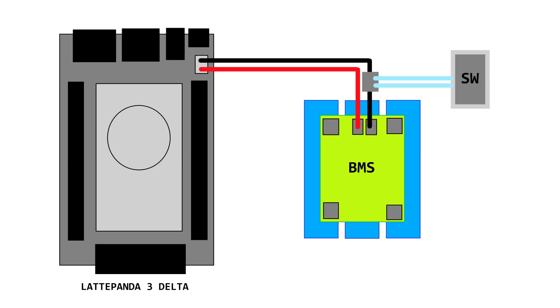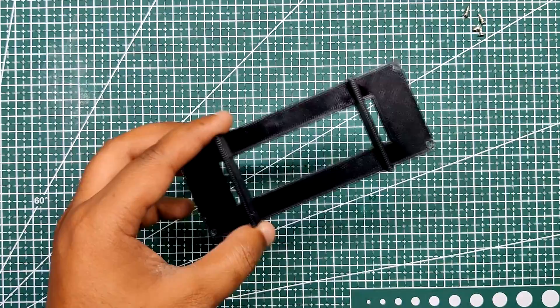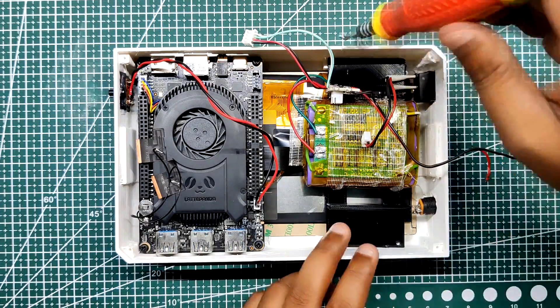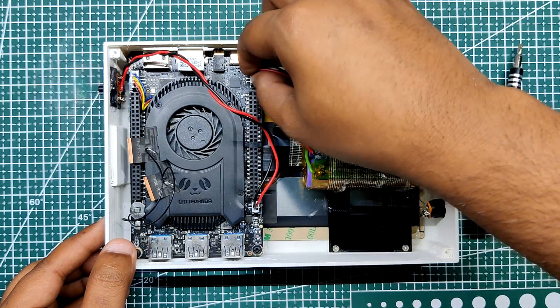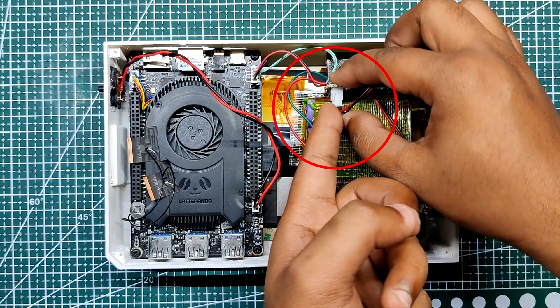There's also a con-2 connector between the ground of the battery and the ground of the LattePanda. The idea is to connect a rocker switch with this con-2 to manually break continuity — this acts as a kill switch that turns off the main power by disconnecting the battery from the LattePanda. We add the battery pack to its battery clamp using hot glue, place the clamp inside the base body, and secure it with four M2 screws. Then we connect the 4-pin JST connector of the battery pack to the LattePanda power input connector and add the rocker switch 2-pin JST connector to the battery pack connector.